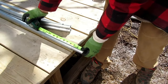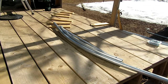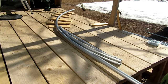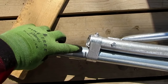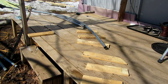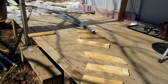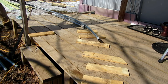Next up is bending the poles. This is probably the trickiest part of the entire build. If you're interested in a more in-depth tutorial on how to bend the poles, I have a link to a video in the description. The way Nate did it is he bought this pole bender from Bootstrap Farmer — this is the 12-foot option. He measured up 9 inches on each end of the pole to make sure there's a flat end on each side of the hoop so it'll sit in the rebar with a flat section on top to run a board across. One thing to be careful of is not to overbend the poles — keep them flush to the pole bender and don't pull too far beyond that, because that'll end up kinking everything. We ruined a couple poles that way, so hopefully you can learn from our mistakes.